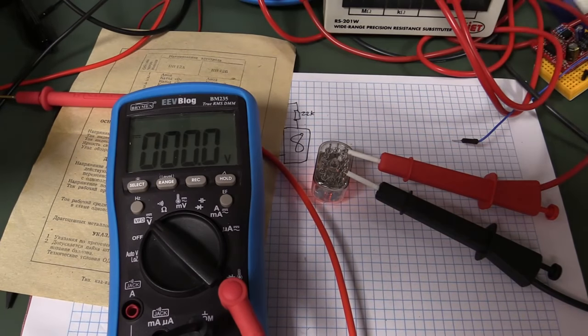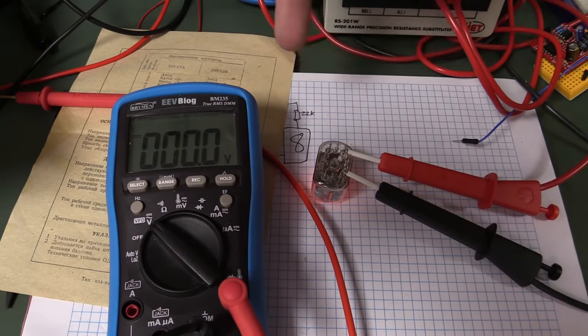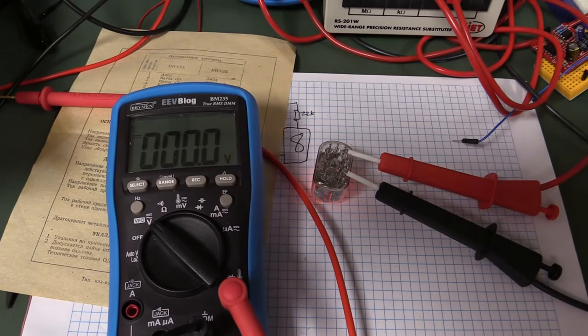That means that just for this particular Nixie tube, there's obviously great variation in this. So I could go measure all eight, but yeah, you're probably not going to get this from any data sheet. So that's the kind of open circuit voltage withstanding voltage you need, the voltage rating of your driver transistor, or your driver transistor array, or whatever you're going to use to actually drive this thing. So yeah, afraid you can't get away with relying on the voltage drop of the Nixie tube itself. So I hope that cleared that up.